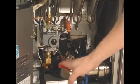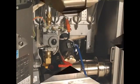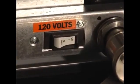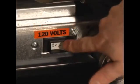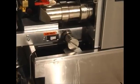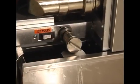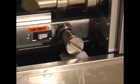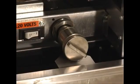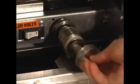Moving on to a little troubleshooting, if you pull the red return handle and nothing happens, here's what to check. There is a circuit breaker located above the filter pan on the left side, labeled off, on. This is a circuit breaker and should always be in the on position. If the circuit breaker has tripped, check the strainer cap for cleanliness. Any debris on the strainer means the paper is torn or installed incorrectly. Use hot water to clean the strainer and inspect the paper for issues. Reinstall the strainer cap hand tight.